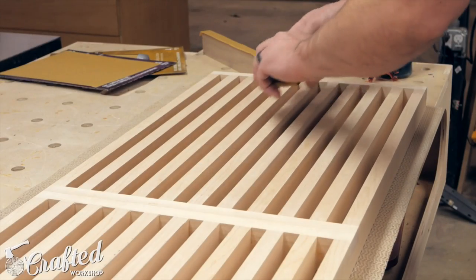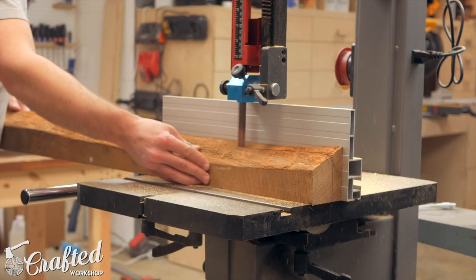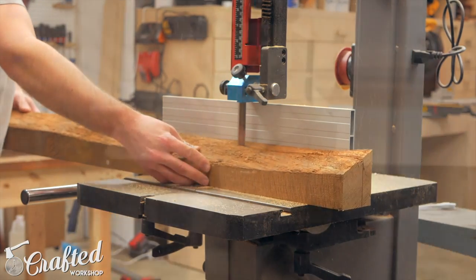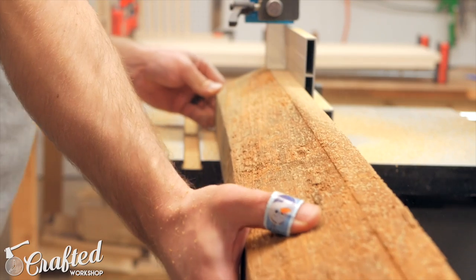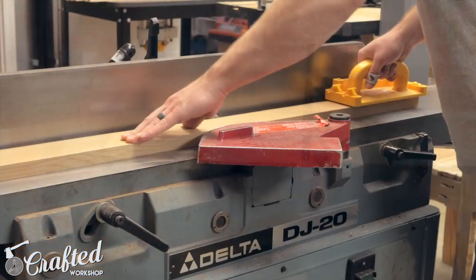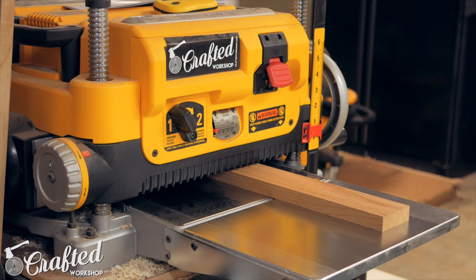Finally I eased all the edges, making sure to still leave them nice and crisp. With the benchtop essentially done, I moved on to the legs. I decided to use a huge chunk of oak I had laying around, but I based the size of the legs on a standard 1x3. If you're buying 1x3s for both legs, you'll need two six-foot long 1x3s. I milled the chunk of oak to size with the bandsaw, jointer, table saw, and planer, then moved on to cutting the leg pieces to length.